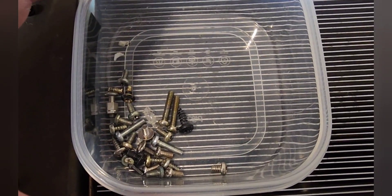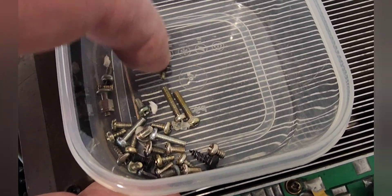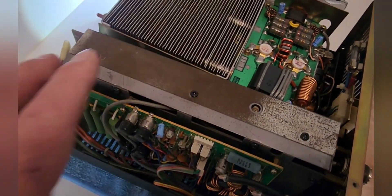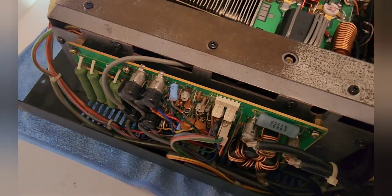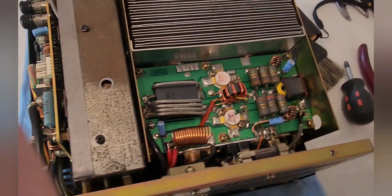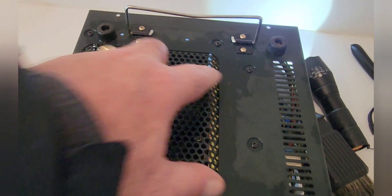So what I've done: if we look at the amount of screws there, they're all M2. They're all meant to be in M2 spots, including this self-tapper that was forced into one spot. The only proper screw I'm going to reuse is the spacer on the regulator board. That had a self-tapper in it, yet all of these M2s I was able to re-thread and clean the thread, and they tighten up as per factory. Black screws throughout the whole bottom — they all fitted, there are no stripped threads at all.